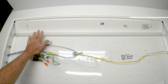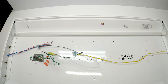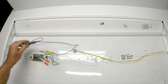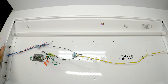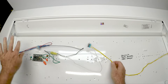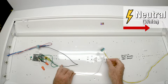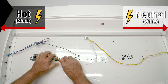We can use our new tubes in here — they work with a ballast, without a ballast, single end, or double end wiring; it doesn't matter. I wanted to show you the wiring because it's really dirt simple. We took the ballast out — we have a full video showing every step. We cut the wires and took all the wires from one end and joined them all together — didn't care what color they were. Then on the other side, we took those wires and joined them together separately. Then we brought in our power — black and white. We took the white and fed one end of the fixture, took the black and fed the other end. Done. It's all sealed up.